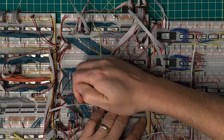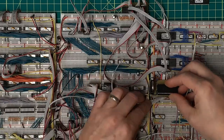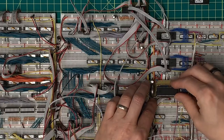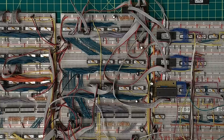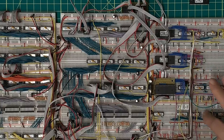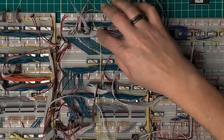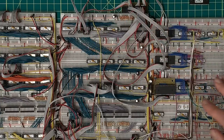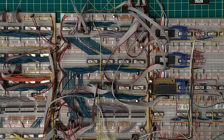I want to get my homemade EEPROM in here. I'll stick it here for control ROM 1 — it's the closest to me. I need to make sure the pins are lined up correctly. That's in there, so I can use it, I just need to program it first. All of this was related to what was coming off the least significant bits. Now I have to find a place in the control ROM to determine exactly how that's going to be. For that I want to make my next steps in code, not on the breadboard.